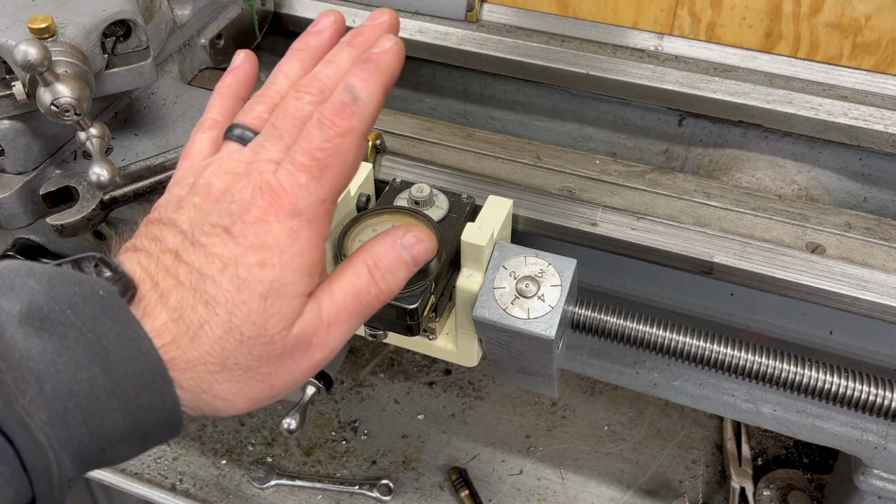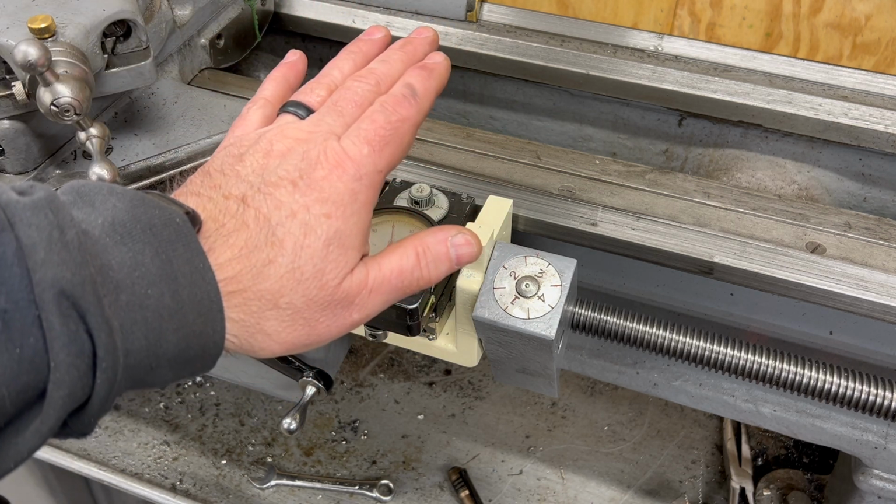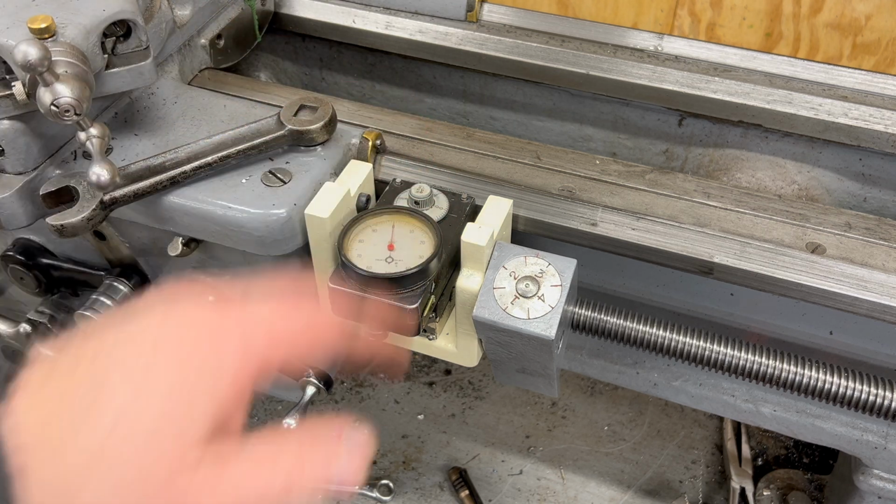What this does is it adjusts what part of the wheel is making contact with the lathe bed. I'll try to explain this the best I can. So it's first important to know that the wheel that the Trav-A-Dial is using is actually crowned on the edge. Well, this drawing is meant to represent the wheel as you were looking at it from the side, butted up against the lathe bed here, which is that gray box on the right.